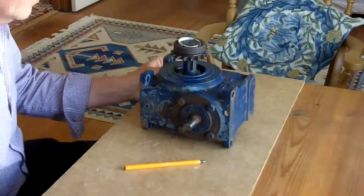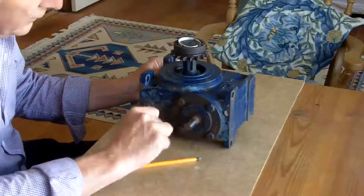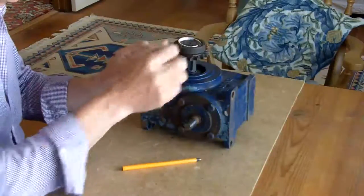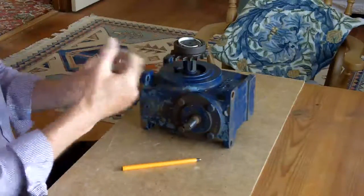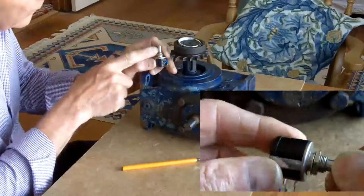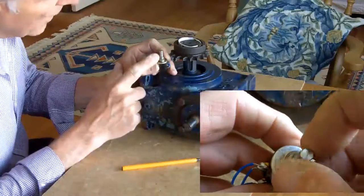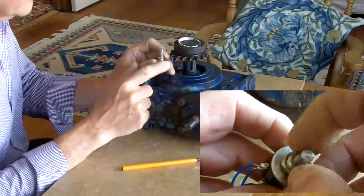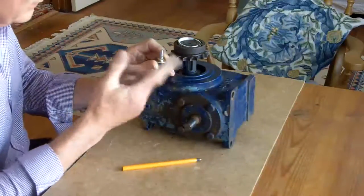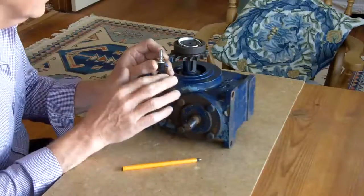The other thing I want to do is a positional indicator — to actually show which way it's pointing. You can think of all sorts of complicated gears, chains and so on. But I'm going to drive something like a 10-turn potentiometer — I'm only going to be using one turn. That gives me over-travel, and then I can trim out any voltage difference and display that position on an analogue meter. That'll certainly be accurate enough for what I want.